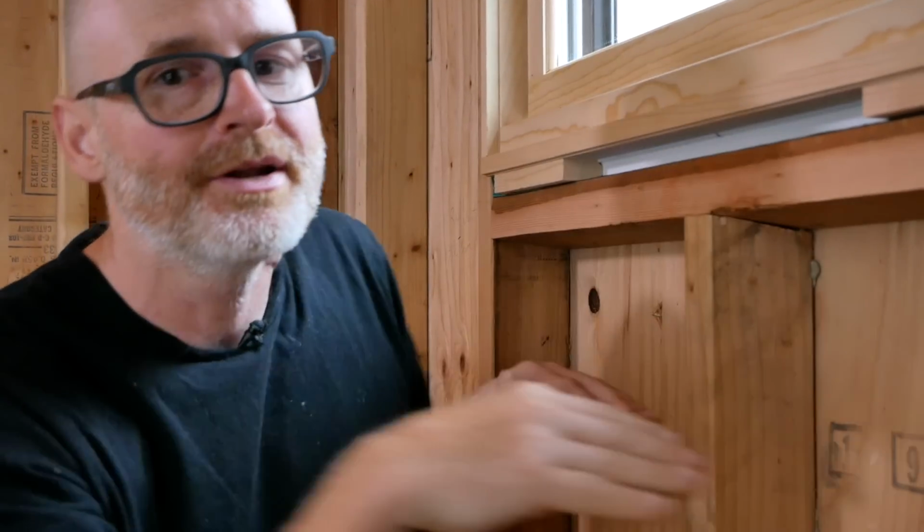right here at a 5-degree angle and then just take a normal piece of 2x4 lumber and put it on top of it. It's already automatically sloped, but not so much that it interferes with your plywood nailing on the inside or the outside. And that's a tip that I picked up from Matt Reisinger over at the Build channel. Lots of great building information there as well.